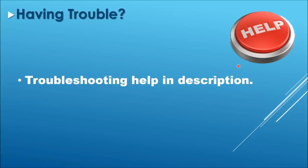And obviously, if you're still having issues, you may have something else relative to the broadcast towers. Keep in mind, they are human too, and they do have issues. In fact, recently, the CW14 channel in my area had issues ever since Comet TV went on the air. I was getting pixelation on all of my TVs. I'm freaking out, I tried to go up on the roof, re-aim the antenna, thinking to myself, what the heck is going on? I couldn't figure it out. I'm thinking multipath, because that's when it was on that chimney.